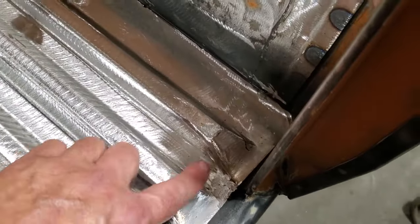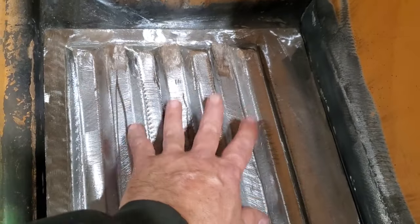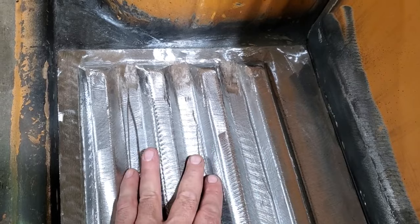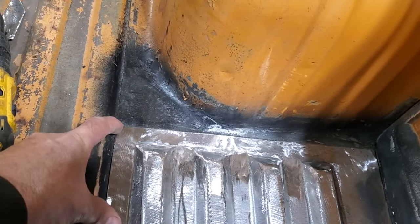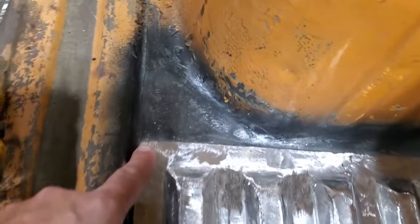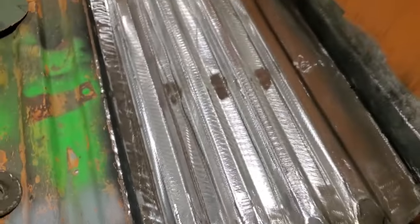And of course the rolled edges on it going up along there, and the nice consistency of the two beads, using that piece of steel to cut it all out, and the overlap, rounding off little corners, very subtle things that you can do, right? Because that's the way the panels were. I round them off just a very slight bit, rather than having them sharp or square, right?